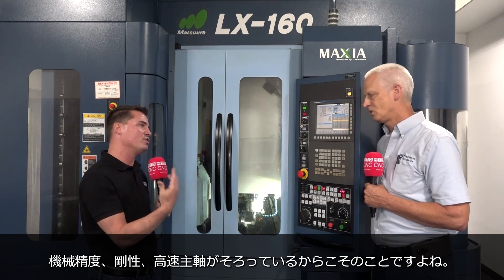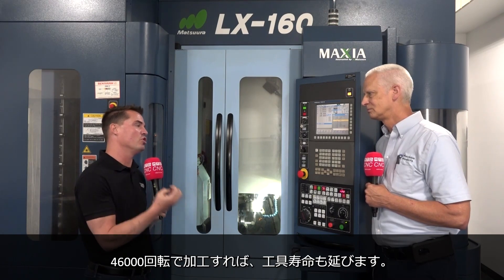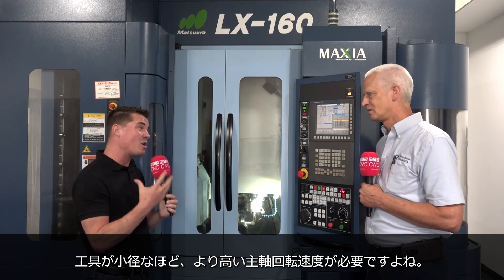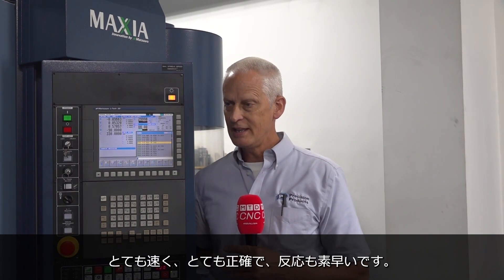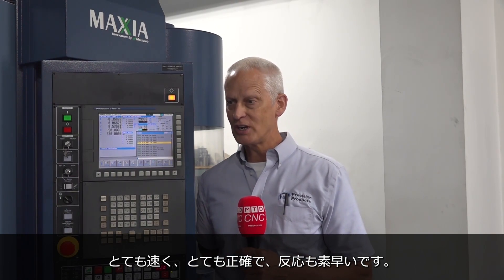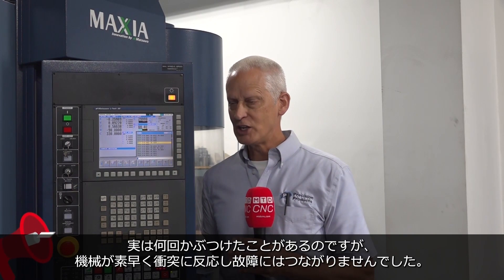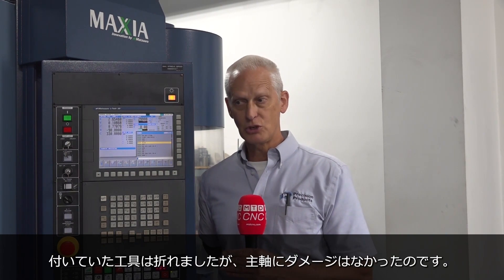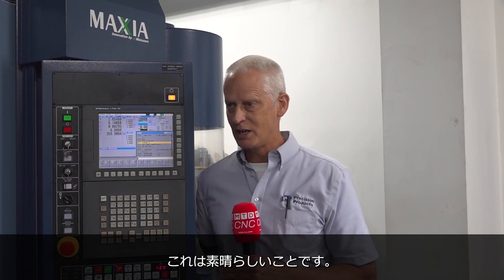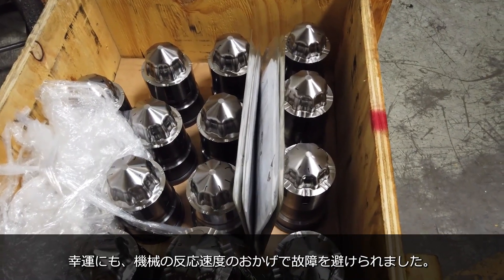That's what happens when you have the accuracy — reducing runout, having that rigidity and 46,000 RPM gives you greater tool life. The smaller we get, the higher RPM we need. This machine is also driven by linear magnets, not a traditional ball screw machine. It's very fast and very accurate. In the event of a crash, it's the original spindle from six years ago, still running 46,000 RPM all day. It's been wrecked a few times, but the machine reacts so quickly to a crash it doesn't damage itself — it'll break the tool but won't damage the spindle. We've had great luck because of the speed of the machine's reaction.